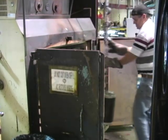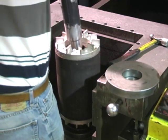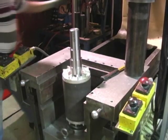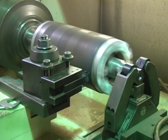Aluminum cast rotors are preheated to minimize mechanical stresses during shaft insertion. The shaft is pressed into the rotor ID to create a completed rotating shaft assembly. The rotor OD is trim cut to obtain proper air gap tolerance.